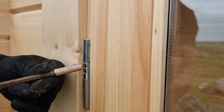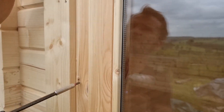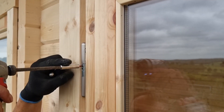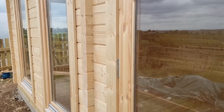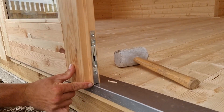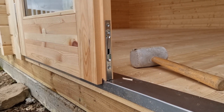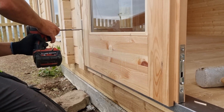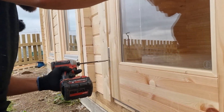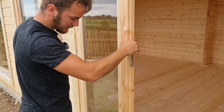If I tighten that — you see that lifts this hinge up. That will give us that adjustment here. So now you can see we've raised this a little bit. A lot of people get it where the door drags on your threshold, which is no good. That will stop you dragging on your threshold. Feels nice.